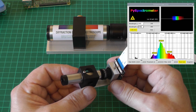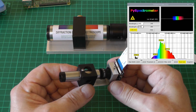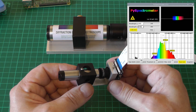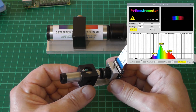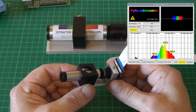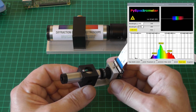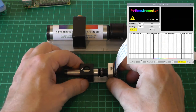There's our spectrum. It's a little difficult to work out where the end is - I can see 700nm popping up at the peak, so we're just into the near-infrared. But this isn't the best way to run the software; we've got too narrow a view. Let's disassemble this and replace the lens.